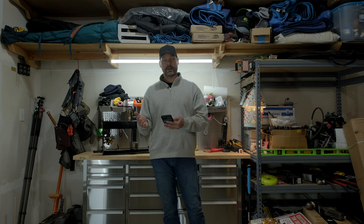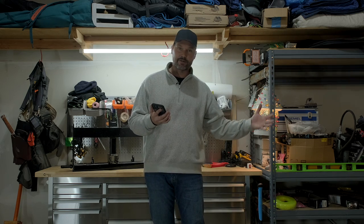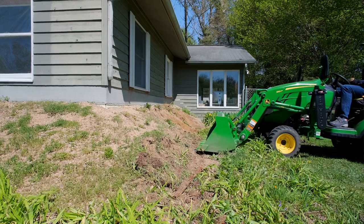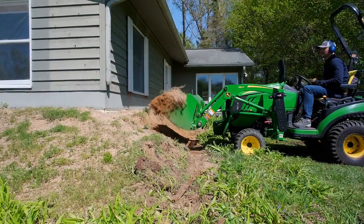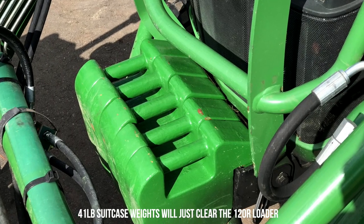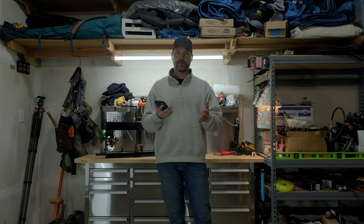On the front side of the tractor, if you're brush hogging or rototilling with a heavy attachment on the back, you want something on the front to counter that weight and maintain your steering. Maybe the easiest way, as long as space allows, is to keep your front end loader on with a bucket and fill it up with a scoop of dirt — that gives you plenty of weight up front. Another option, whether you have the loader on or off, is to hang suitcase weights right on the front rail. On the 1025R, you can put five 41-pound suitcase weights there even with the front end loader on, giving you an additional 200 pounds up front to help maintain steering ability.